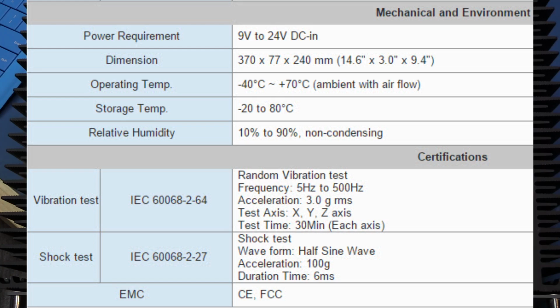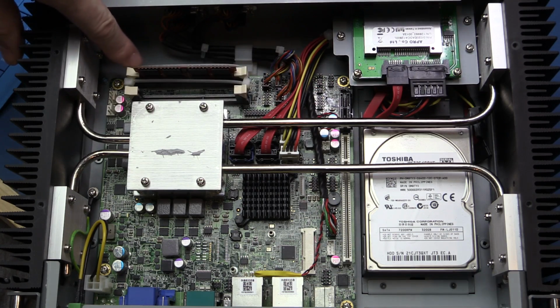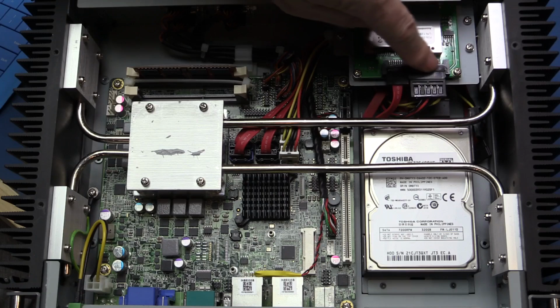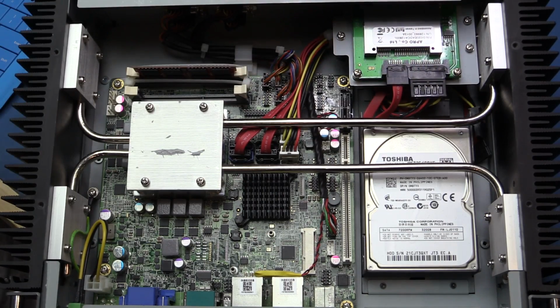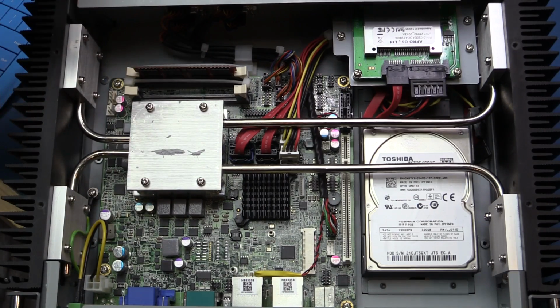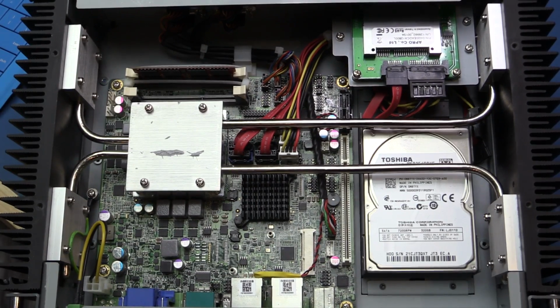So that's quite extensive mechanical structure integrity that they're ensuring here, which is why obviously, when you look at, say, the SODIMM here, they've actually put a cable clamp around it to make sure that even when it's subject to vibration, these clips are not going to be coming apart. Up here you can see that the SATA cables have a little bit of adhesive that holds them into place so that they don't come loose. Everything is either screwed down, bolted down, or glued down to make sure that there's nothing going to be breaking apart and reducing the reliability of this PC.